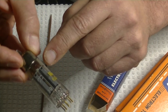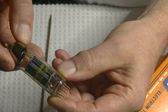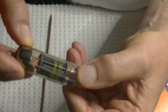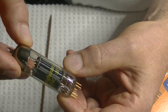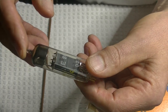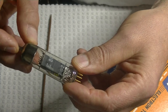On the real Philips they only have two little slots, and they'll have the Philips manufacturing code — the backwards upright triangle. It's got a really clear manufacturing code with the date, the tube type, and the plant. The plant is Heerlen in Holland, the main Philips plant — the equivalent of Blackburn for Mullard. And in fact, Philips owned Mullard.